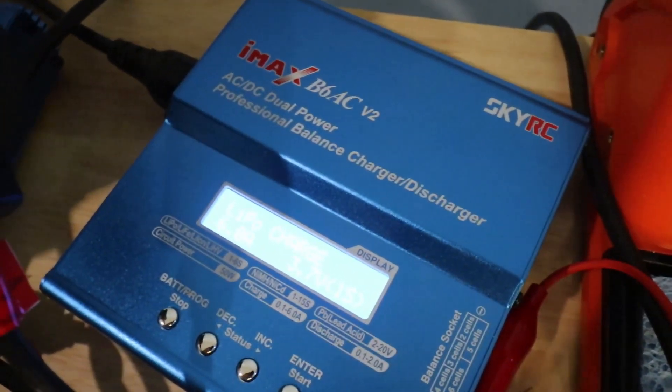Just a quick review — I actually built this battery for a customer and I'm going to be selling it, but I wanted to show you what it was and how well it worked. I did some capacity tests and could pull about 65 to 70 amp hours out before hitting low voltage on any of the cells from the BMS, and they were all pretty well balanced. When charging, the cells stayed in pretty good balance, and it's only at the very top of capacity that cells start becoming unbalanced — I think that's fairly normal. What I did was hook them up to my SkyRC B6AC charger and charged each cell completely with that, then hooked up the BMS and cycled the batteries. That way they are top balanced, and the BMS will continue to balance them out a little more each charge cycle to keep them in line.